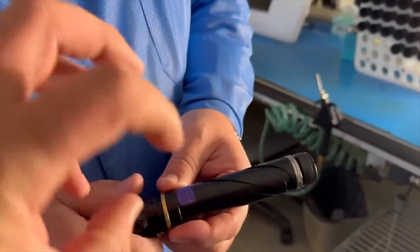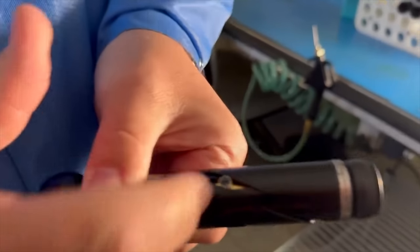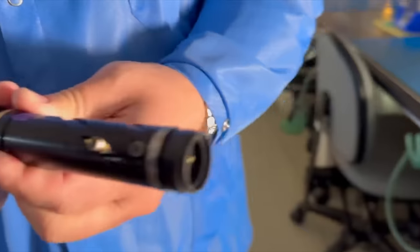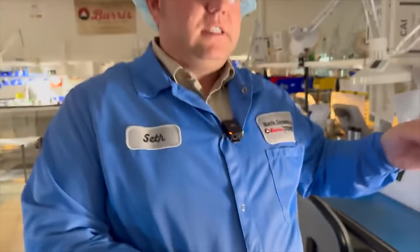So that's when I change the magnification. So it's running along those tracks. As you change that magnification, see how it's moving. These lenses— Whoa, that's cool. These little brass carriages hold the lenses. It's going to move those lenses in perfect harmony to their different positions to make sure that the reticle stays in focus, and the object that you're looking at stays in focus no matter what magnification you're sitting at.